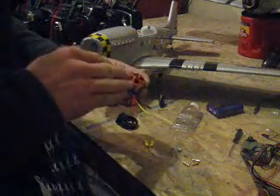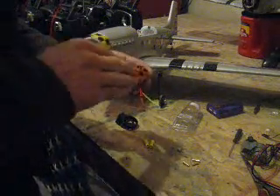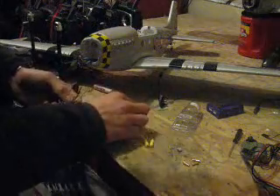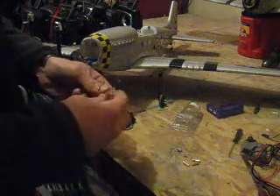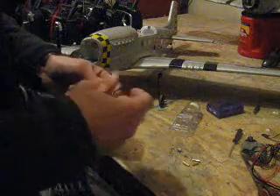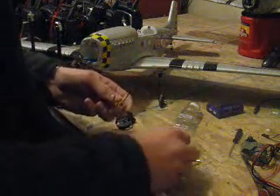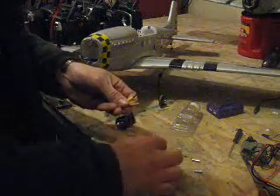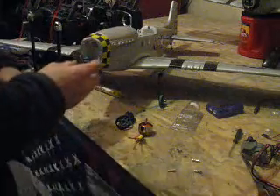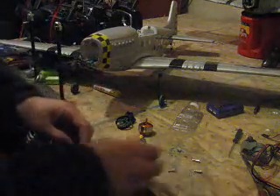The 1,600 kV rating means that for every volt applied, this motor is going to turn at 1,600 revolutions per minute. Got our GWS stick mount — a dollar off eBay. I'm putting the shrink wrap over the wires already; it's just a good habit, because every now and then you'll solder something on and it's too big to fit the shrink wrap back over. Got our female bullet connectors hanging out the front and the soldering iron should be plugged in.